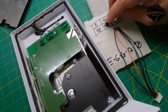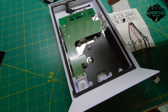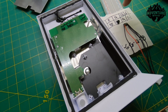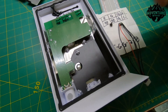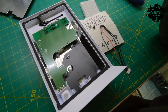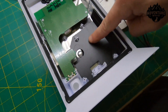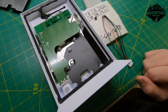You could use little screws to hold it all back down — there are other ways to do this. The only other video I saw on this topic is a great reference — someone's workshop, maybe Kevin's workshop. He added Wi-Fi heat sinks on the other side. I had some like that, but this is for off-road use and I'm very much worried about vibration. The SpaceX team did all the nice engineering for this case and heat sinks and figured it was adequate with the AC board attached, so without the AC board and with actual ventilation, this thing should be happy. Adventure Brad out!